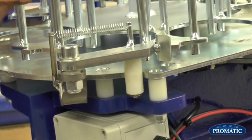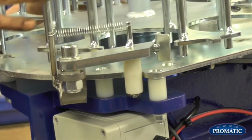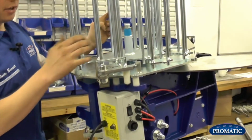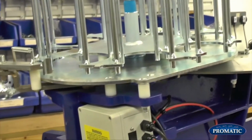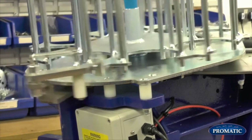When we're actually coming to set it, you don't worry about the position of the carousel. Basically what happens, if we move the rear pusher shaft around so it's in between the pockets of the carousel, when we start moving it, you'll see he comes back, and now he'll self-time himself. He'll push the carousel, he'll come round, he'll grab hold of it, push it, and then off we go again.